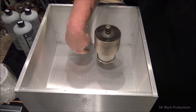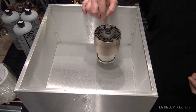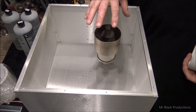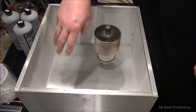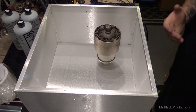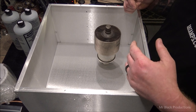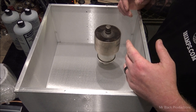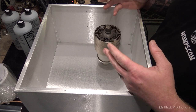He has holes drilled in the bottom of his deck to cool his filament on the bottom side, and then he's got vents on the bottom. But 99% of the air comes out of the top. The air blows in or runs across all the components you have to worry about heating, the tank coil, that kind of thing. And as I'm standing there looking inside this deck, at all the beautiful silver work, I was like, well, there's nothing discolored, there's no heating, there's no nothing.